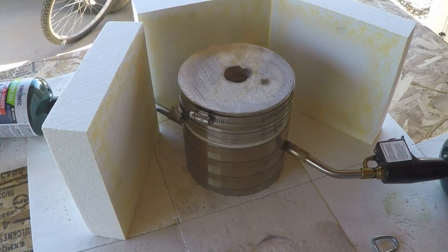If you open the cupel up and it doesn't remain hot enough, it's what they call frozen. The surface cools off enough to become solid instead of a liquid burning pool of lead. Then you either put the lid back on and get it to go again, or sometimes it freezes hard enough you can't get it going again. So cupeling is kind of a tricky little thing to do, but once you get used to it, once you learn about it, it's not too awful bad.